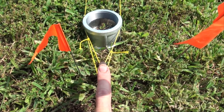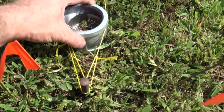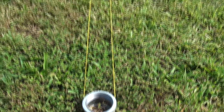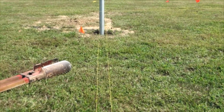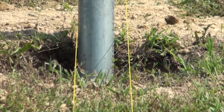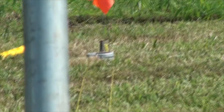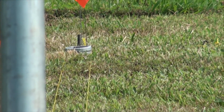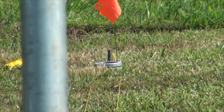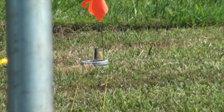This rod marks one of the grid lines, and it has two nylon survey strings connected to it. A small two-inch coupler separates the two strings, which gives a reference line in the left-right direction. On the other side is another coupler and a peg. A couple of days ago the very first task was getting all these pegs lined up perfectly — a long, tedious job, but very important and it's paying off right now.